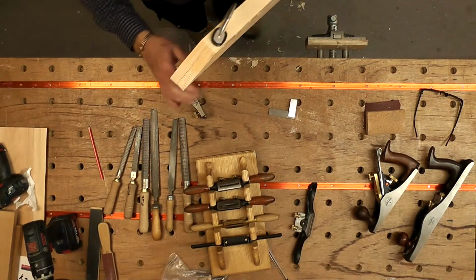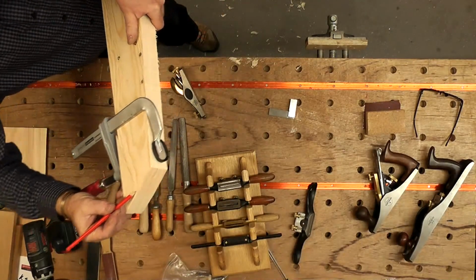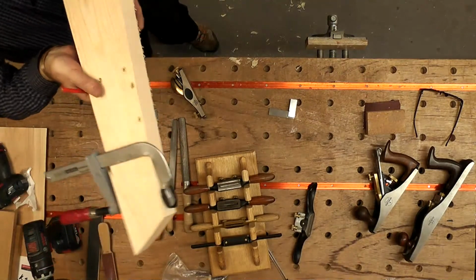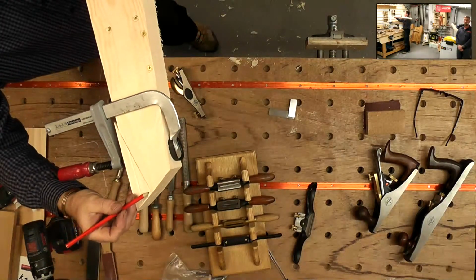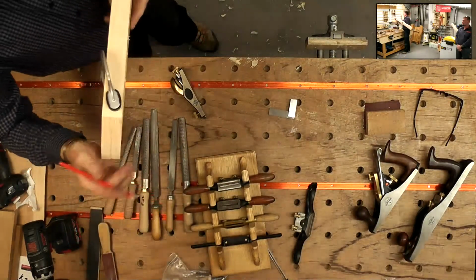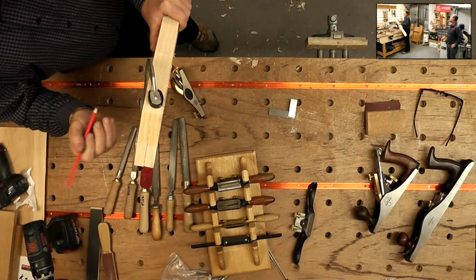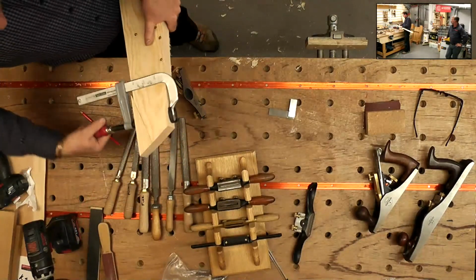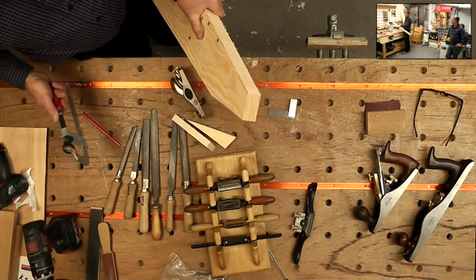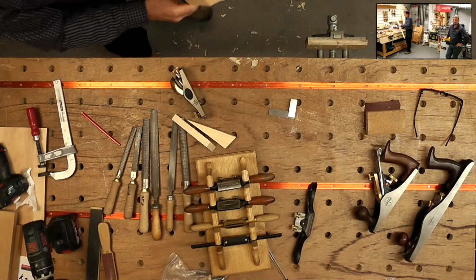So a little block plane. Now, the wedge bits end down here. Oh, got to change grip. Right down there, hopefully you can see there's a join line there. So I've cleaned up without dropping things there. But they've added a bit of support, to stop anything splintering out as we're planing it. So simple to do. Take them off. So adding strength to those fibres we've got underneath.